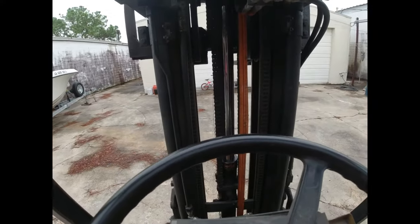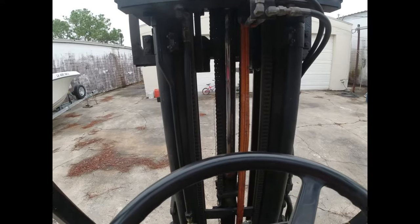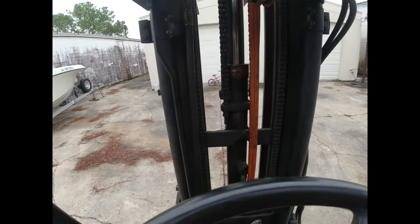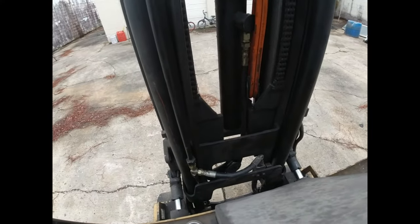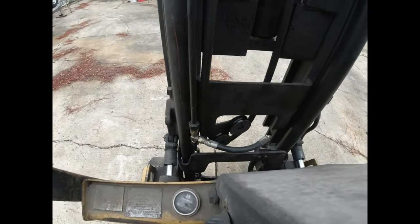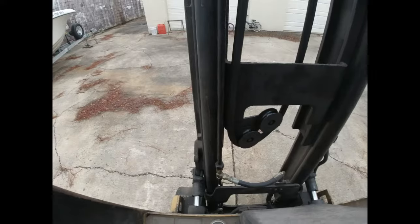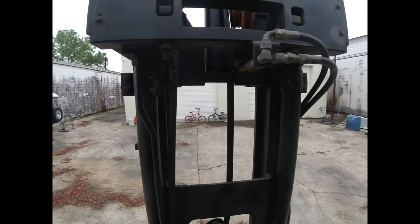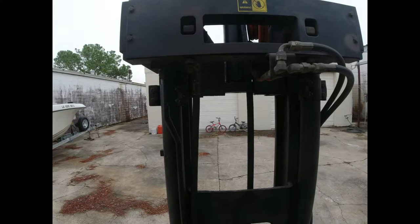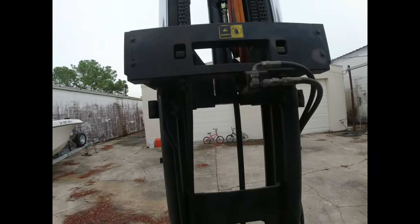Right here is where the bottom cylinder is extended all the way out and the other two cylinders take over. And here you can see that hose that gave me so much trouble. It's because the little rollers come up half as fast as the bottom frame - so it's almost four to one. For every inch I was able to pry that thing off the ground, I was getting four inches of hose slack. If I'd known that in the beginning and been smarter when I chocked up the upper part with the two-by timbers, I would have just chocked up the bottom part too and it would have been done.